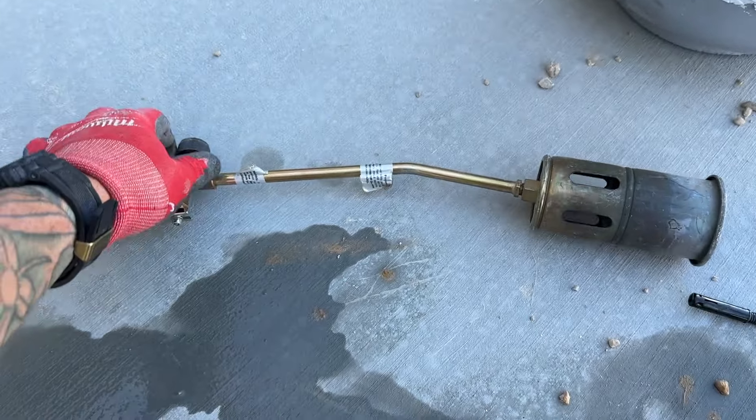You're then going to probably cut the ends again, just because sometimes when you're heating it and grabbing it, it may distort the shape. I trimmed it just slightly to get a good circular shape. If you want to make sure it fits perfectly into your tee fitting, you can grab some pliers and squeeze the end of the pipe a little bit to shape it back to circular. We're going to use some PVC glue, put it on that tee, and connect the two pieces to make that full circle. Make sure that tee fitting is sitting flat with the circular shape — I use the ground for this.